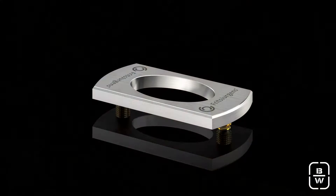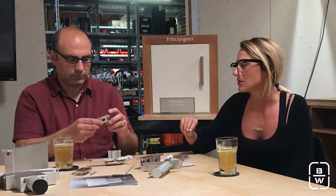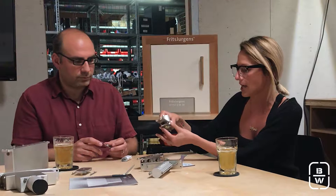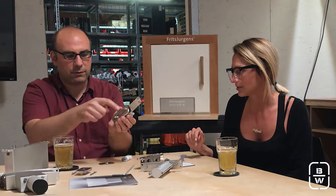The floor plate just has two connection points — you just drill these two holes into the sill, and there's an epoxy that comes with it that you use to put these two connection points into the floor. This literally just sits in it — it's the weight of the door that supports it. At the top, for your top pivot, you have the ceiling plate, which is even thinner. So you have two little screw holes and two little screws in your ceiling — that's it. Everything else is in the door.